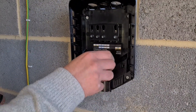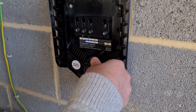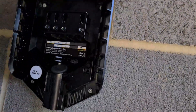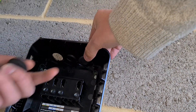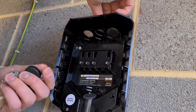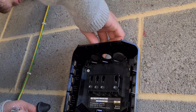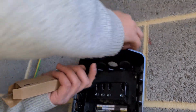They're bunging up the holes they don't need and getting the grommet input for the cable to slot through and into the charge point. Matthew is forcing the stuffing glands — the grommets — into the openings to maintain IP ratings. These are weather-rated so they can be used outside. They are a tight fit, which is what you want — you don't want moisture ingressing to the charge point, especially outdoors. He's selecting the middle hole for the cable entry gland.